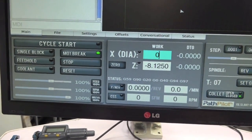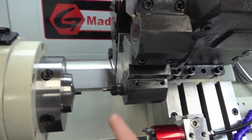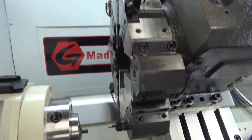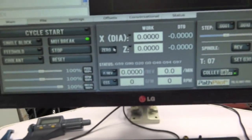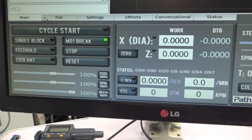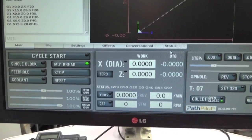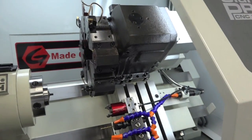Now it's set — you can see X negative 15 and an eighth, Z 8 and an eighth. Zero these two out and this is our home position. The reason we do that is in case there's a part or any obstruction — we know there are going to be no issues during the warm-up code. I wrote the program so that this is zero, it goes 15 plus and then 8 plus back. Now let's open up the warm-up code and there's a reference at home.